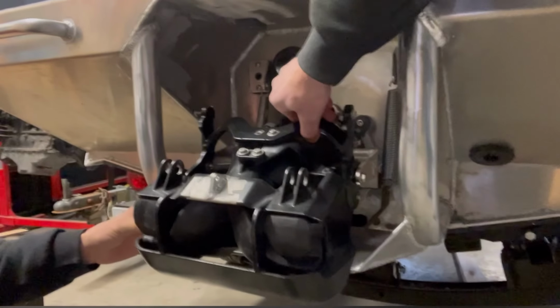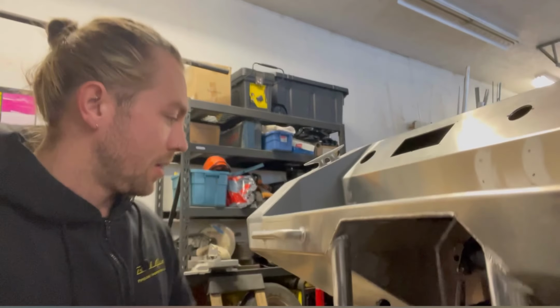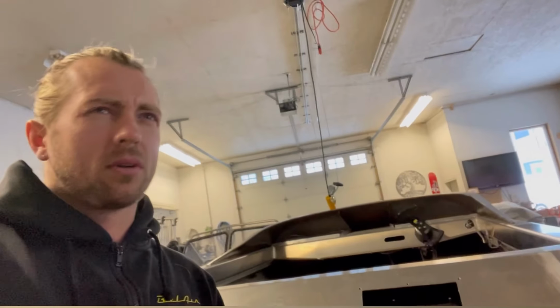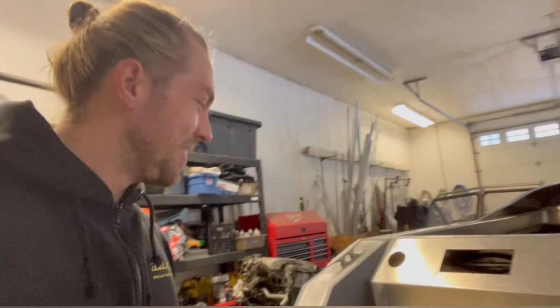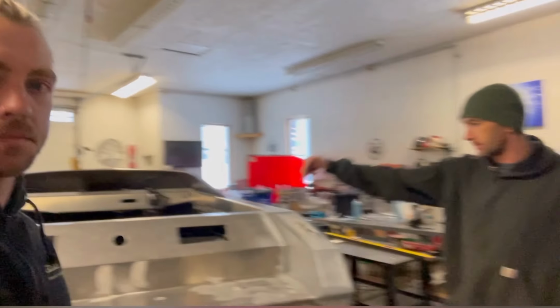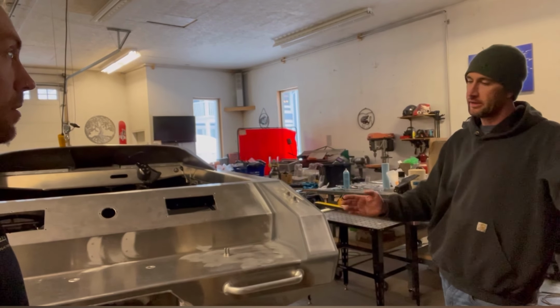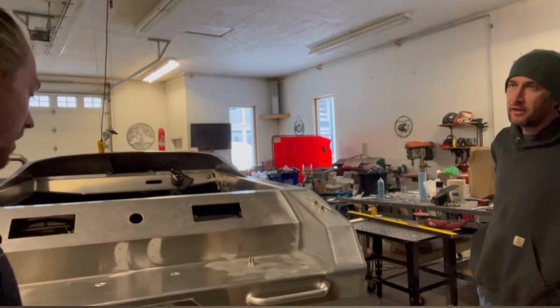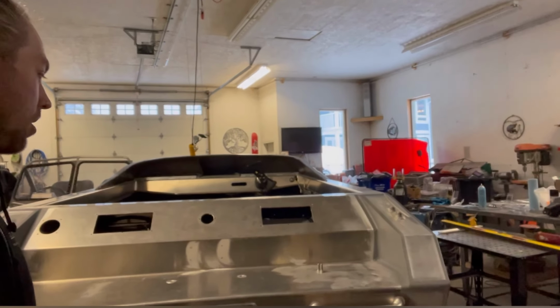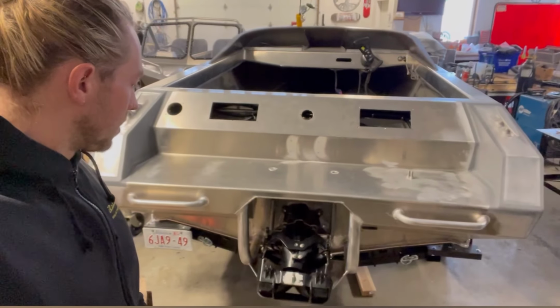And trim. Now we can have a pivot on the trim as well, which, I'm sure you guys will figure out or already know, trim in a jet boat can be a little bit important depending on where you want to go. Well, and also you gain steering control. If you trim up, it's forcing the back of the boat down, which means you have more steering capability. You won't just wash out in 360. This plate under the Nerf bar too, that's going to help from porpoising as well, right? Extending the hull a little bit? Yeah, no, that's super dope.